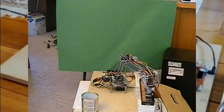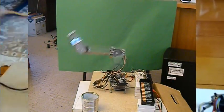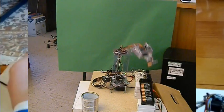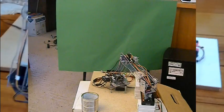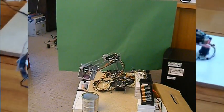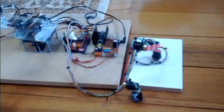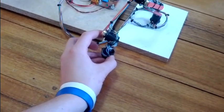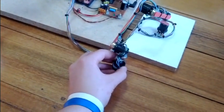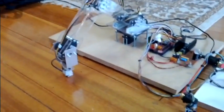I did have it picking up little triple-A batteries from a tray — they're little enough for it to pick up — and it was just moving them from one place to another. You could do it all on the Arduino: have a second button on the end of the controller, one controls the electromagnet and one is a store-position button, so you could move it through a series of points, store the points, play them back in a loop and get it to do stuff.